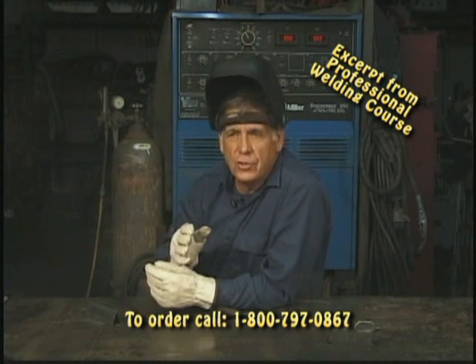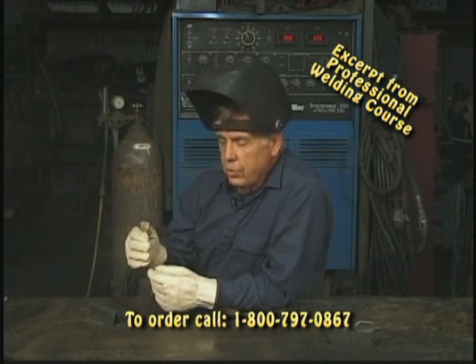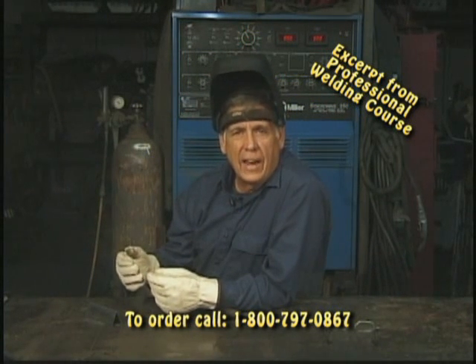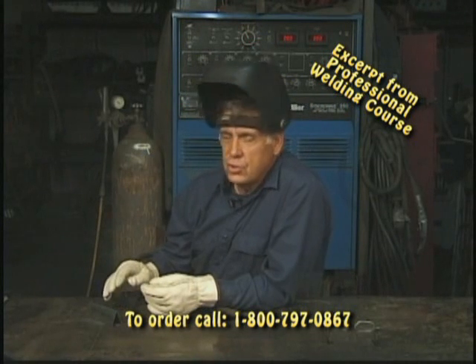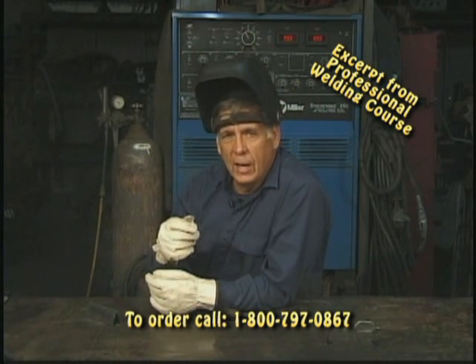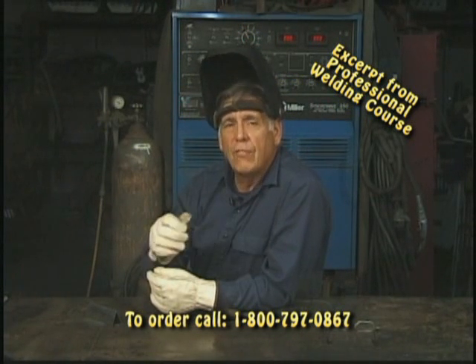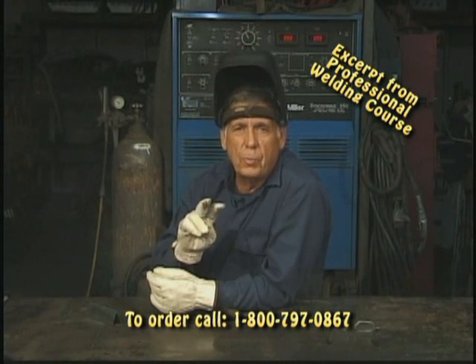The thinner the material, the more tacks you're going to need. One thing to keep in mind: when you're gas welding or TIG welding, there's very, very little slag — essentially no slag in TIG welding. When you want to polish a TIG weld, make sure you've got enough metal in there so that when you polish or clean it off, you still have a sound joint. Remember, we're welding — we are joining two pieces of metal together, and that never changes.